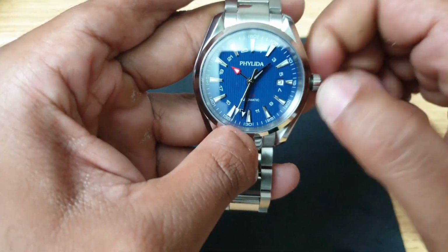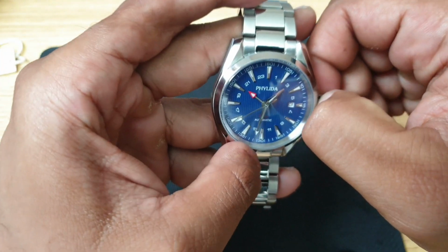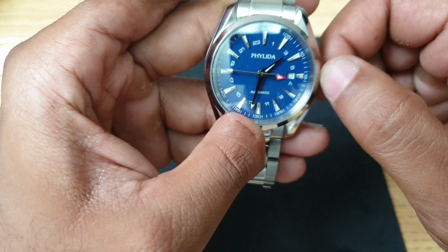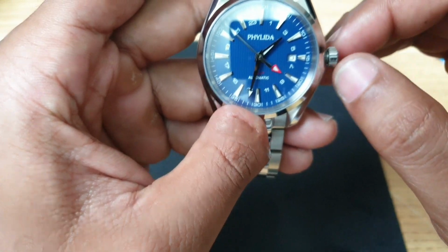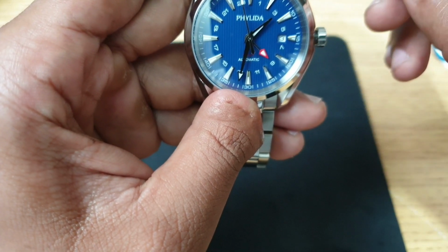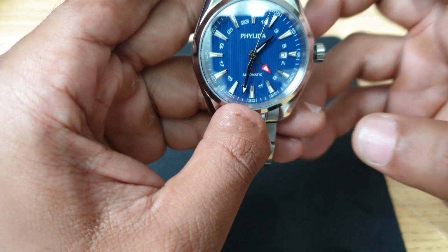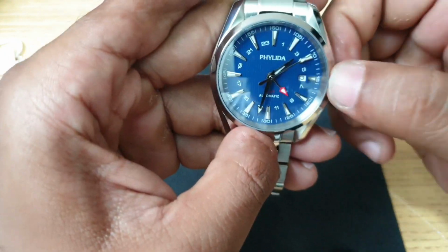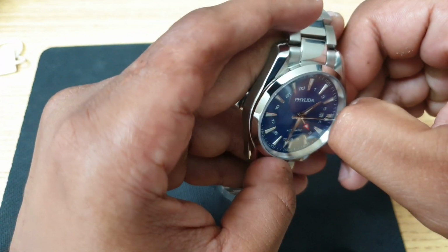You can unscrew the crown. You can hand wind it. The winding is quite audible. One click. If you rotate it clockwise, that will operate the GMT hand. Now, an inherent function of this movement, when you click it back in, the GMT hand does move. Now that's due to some possible slack in the gearing in the mechanism. What that means is, when you set it, you've got to bear that in mind and just put the hand slightly before the actual time you want to hit.